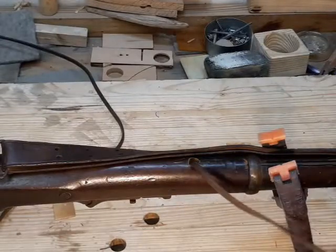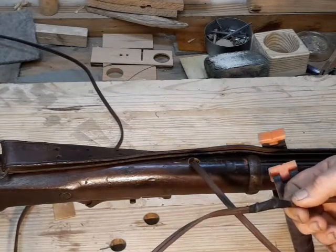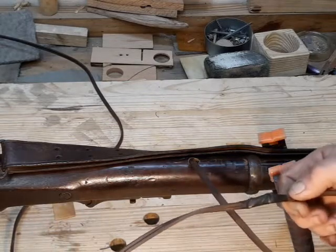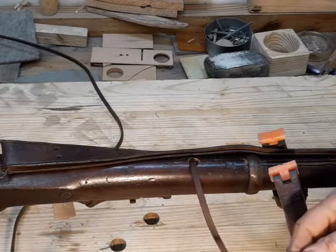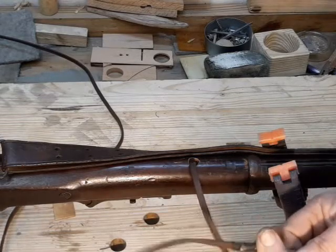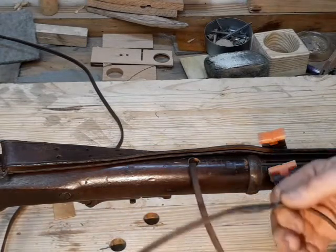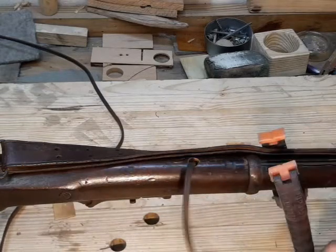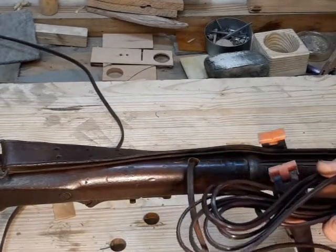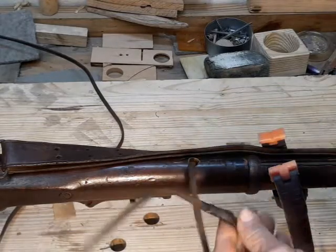Something you see in a lot of home lamp projects, especially tall floor lamps, is that they use a regular table lamp cord, which is 8 feet long — giving you about 6 feet to plug into the wall. For a floor lamp you're going to end up with more like 4 feet, and the usual solution is to splice in another lamp cord. Never a good practice — absolutely never a good practice. Unless it was soldered and well-sealed, there's always a chance it could be pulled apart, leaving a live wire running around your carpet. Cords are available in 12 and 15 feet for floor lamps, and in 18 and 21 feet for swag lamps, so there's no need to be splicing lamp cords in your house.